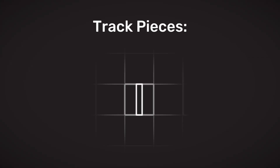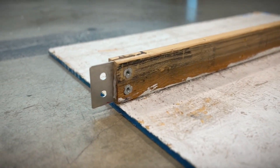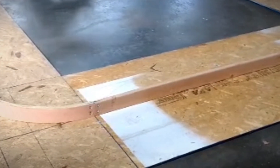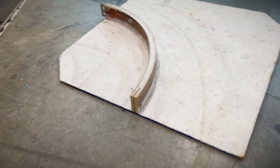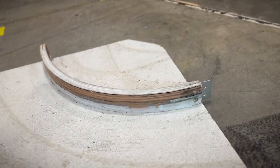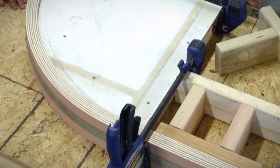Starting from the ground up, the MTR uses three different monorail track pieces: a short straight, long straight, and a curved track. The track is separated into these smaller modular sections to make it easier to assemble and allows for unique pattern arrangements. The short straight track uses a 4-foot plywood base with a 2x4 attached to the top, included with a metal joining plate, allowing for the modules to interlock. The long straight track uses an 8-foot base and follows the same method, while the most difficult track to assemble is the curved track, which needs to form a perfect 90-degree turn so that the track doesn't get misaligned, while retaining the dimensions of a 2x4 to ensure that the chassis can transition smoothly onto the module. The tracks were formed by using laminated strips of plywood glued and clamped together in a curved form to match the dimensions of a 2x4.